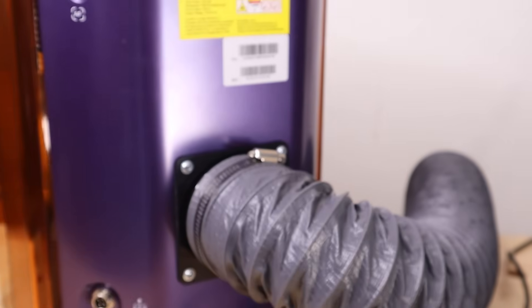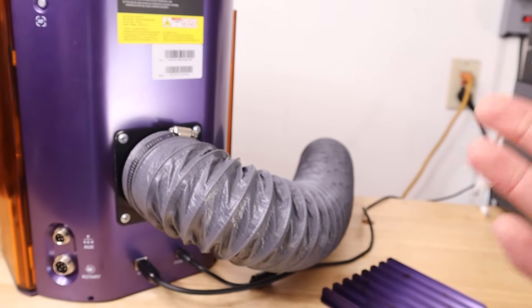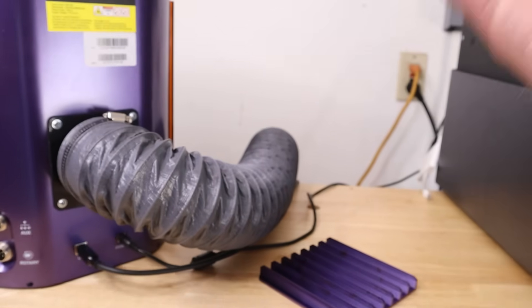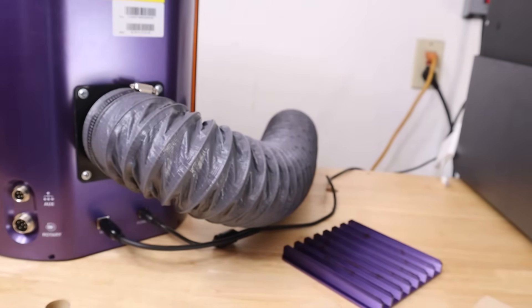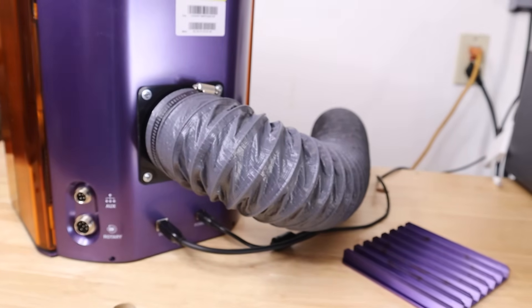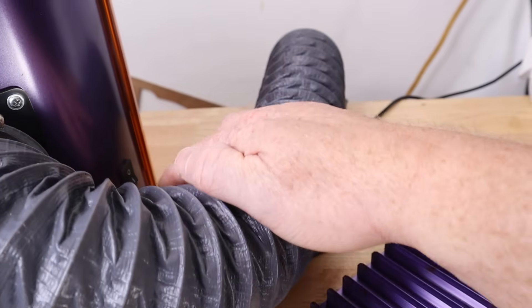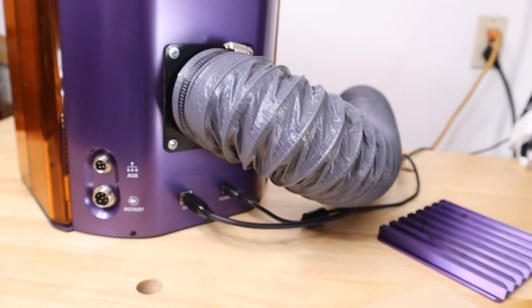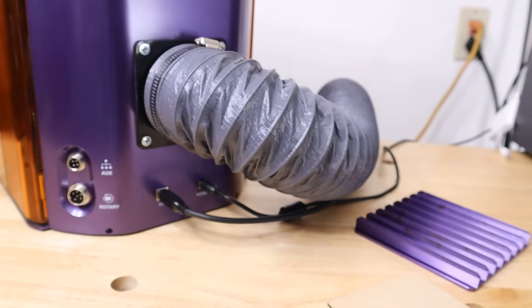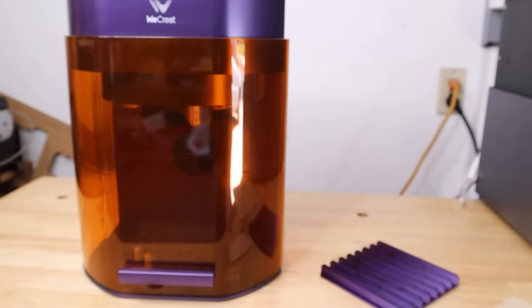What's interesting about this machine compared to similar ones I've used is the absence of an emergency stop button — there isn't one. If you have an issue, the machine should trigger an error via sensors inside; I've actually had it trigger a flame alert when cutting wood. The machine will automatically stop, which is a great safety feature, but if you need to turn it off quickly, you have to reach around and find the power button or cut power at the supply. Those are really your only options.